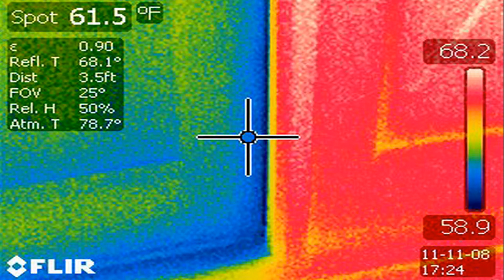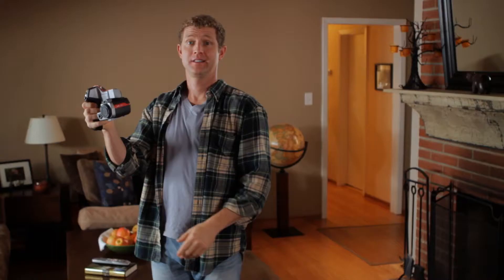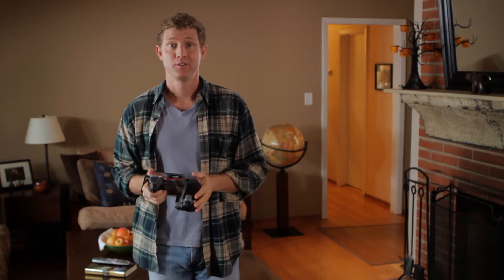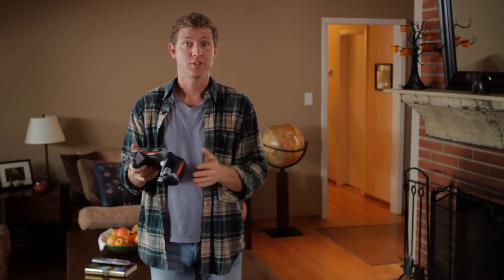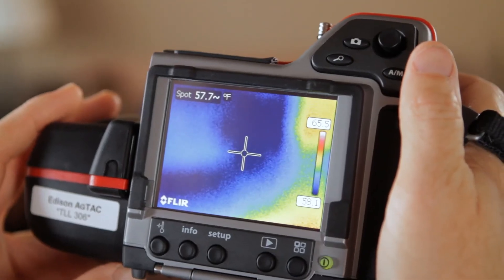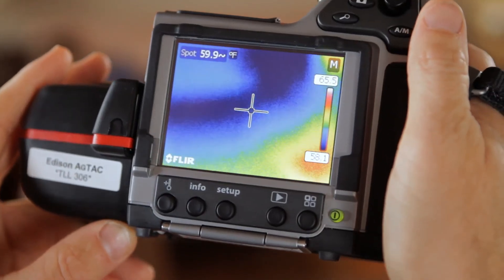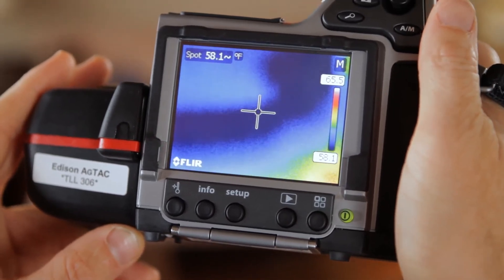And you get an infrared image. The hottest spot will be white, and the coldest spot will be blue — that's pretty much all you need to know. You're going to walk around your house, pointing at stuff. When you see something that doesn't look right, you just line it up in that problem area and pull the save button right on the front of the camera. You just stored a thermal picture of the problem. You may want to start by pointing at doors and windows. And if you've got leaks, you're going to see cold spots — the blue areas.